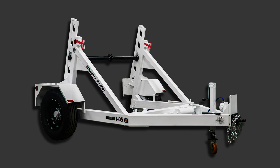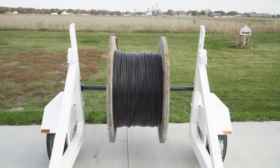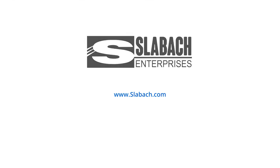Once the weight has been transferred to the transport lock pins, close the release valve on the hand pump. With slide lifts locked into position, visually check to ensure the spool has adequate ground clearance prior to movement of the tow vehicle.